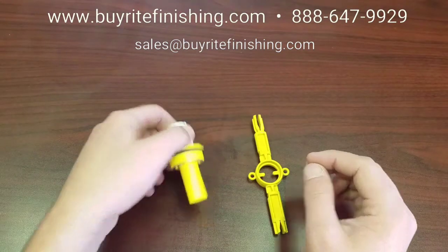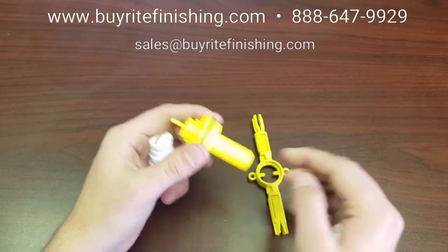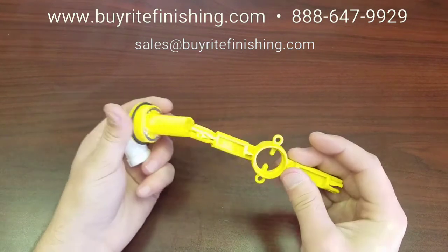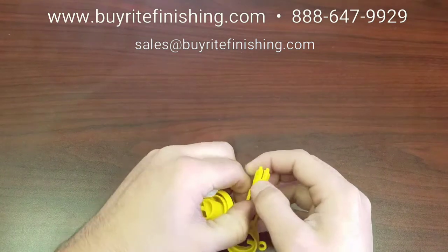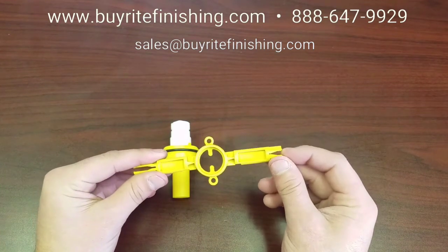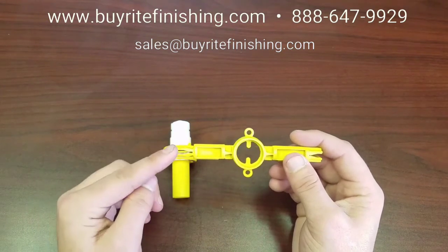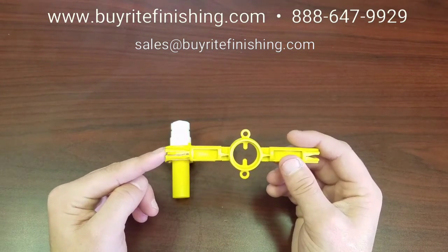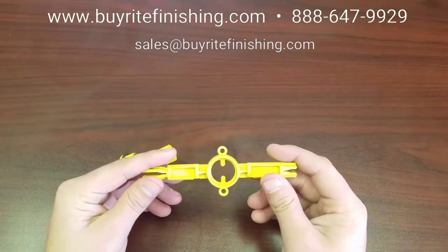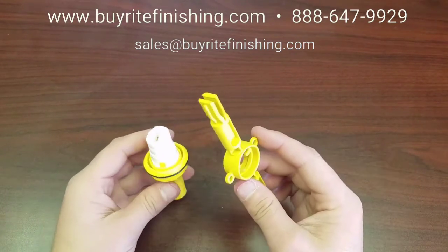The electrode holder should be removed once a month to clean the contact ring, the tip, and to remove and check the wedge for proper wear. You must have a wedge tool to do this. On one end, the shallow slot is used to insert a wedge into the electrode holder. On the other end, the deep slot is used to remove a wedge. This end has a very small lip on the end to help you pull the wedge from the holder. And in the center is the nozzle adjustment ring. This is used to turn the flat spray nozzle, allowing you to adjust the stream to fit your needs.